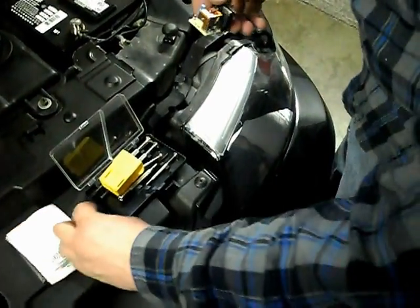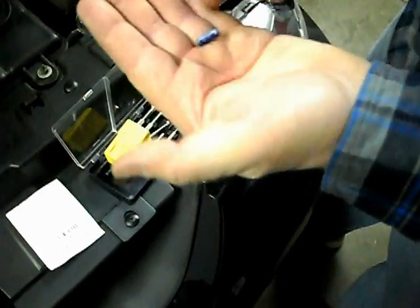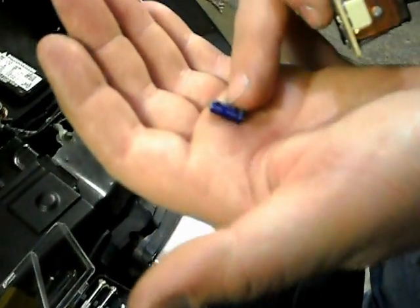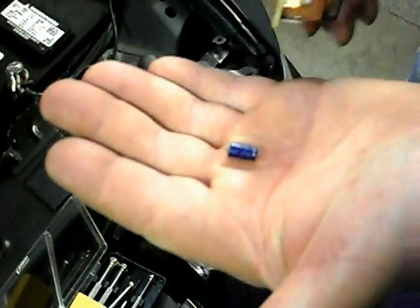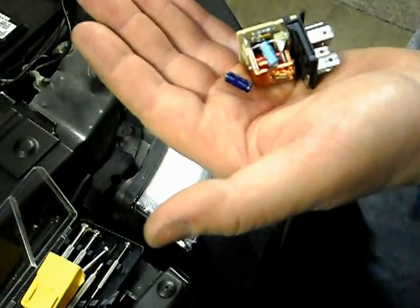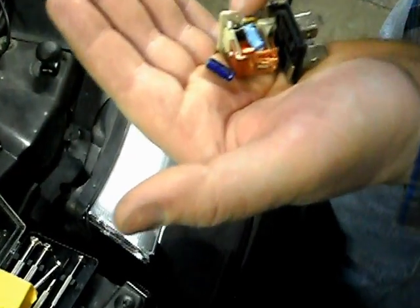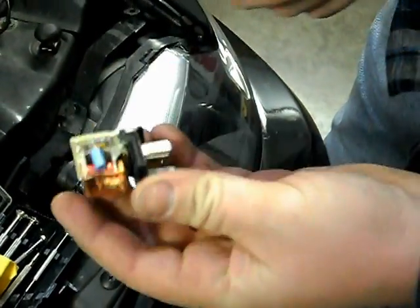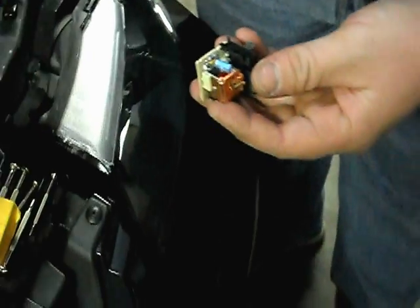The range and this is a 35-volt DC maximum — it's a 4.7 uF capacitor with a 35-volt maximum. This is the old capacitor I took off — I believe it's a 3.3 uF 50-volt. I just snipped it as close as I could, still had my leads out, then I soldered the new one on. Usually it looks like this without the other capacitor, and this is what I came up with.